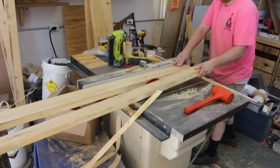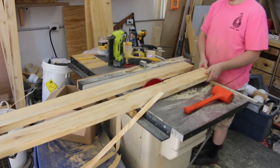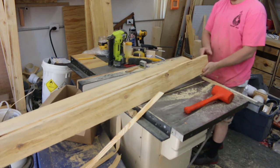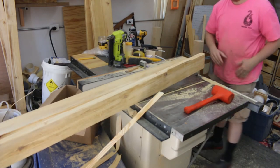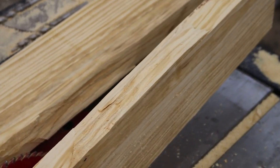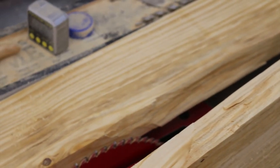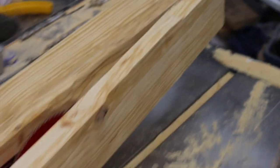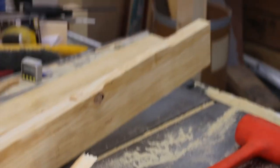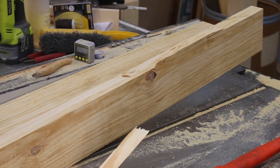There's so much energy and stress in that wood that it basically exploded as I was cutting it. I get the camera in close so you can see basically how it tore itself apart — just pushing against itself. You've got to be very careful when you're working with wood that comes from the big box stores. It's not very well conditioned, and there's a lot of built-up stress.